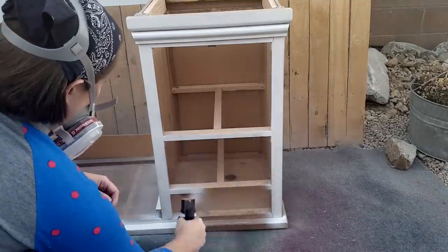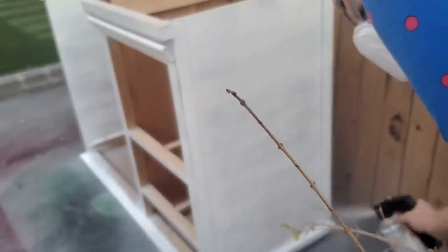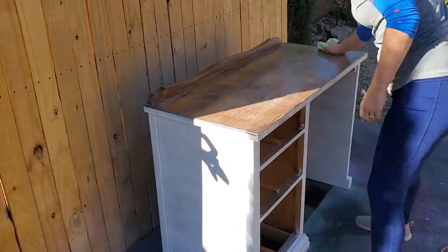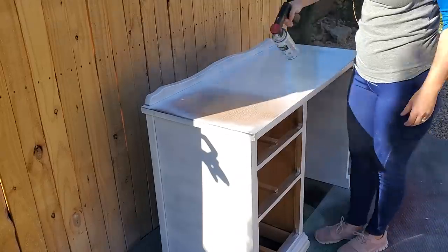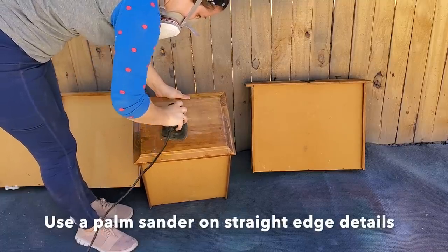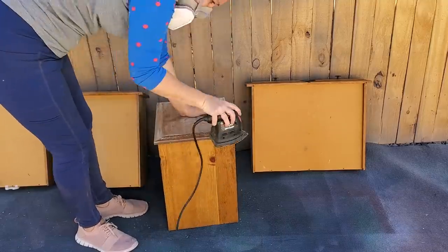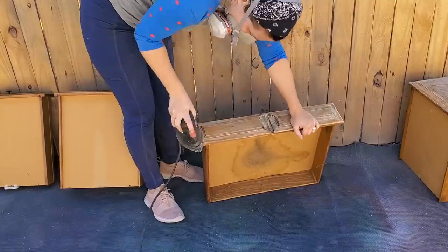I have a couple of flat black Bear spray paints I'm going to try still. But here's that Rust-Oleum two-times-coverage paint in flat white, and it just works amazingly. For those of you who are new, you might be wondering why I'm sanding the desk after I already started painting. This is my method — I paint the bottom first upside down, let it dry, flip it right side up, and then when I'm sanding down the top, if any dust gets on the bottom it won't stick. That way I don't have to tape off any areas. For the drawers, I just used my little palm sander, because there were a lot of straight edges in the details I didn't want to get rounded from my orbital sander, and it reaches into the little crevices better.